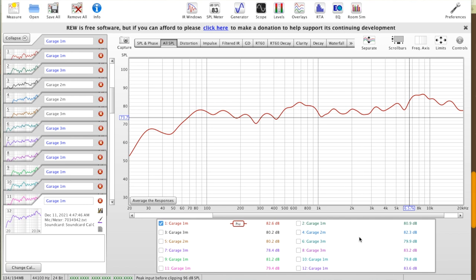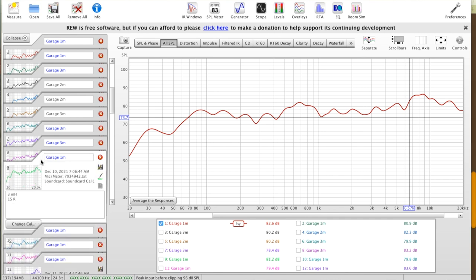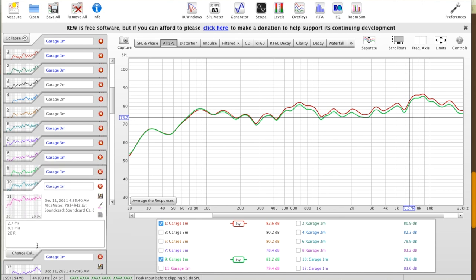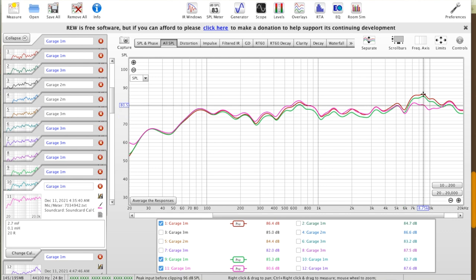So for now, we have our 1 meter curve response. We have our step baffle correction, which is this green one, number 9. Let's do it. Look at that, it's lowered a little bit. I don't know if we're gonna use that, okay? And then this one is our high frequency filter. We turn it on, boom, cut a lot, great. 80 decibels from 86, 6 dB.